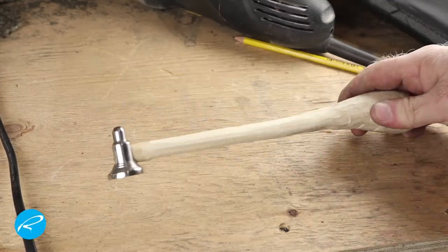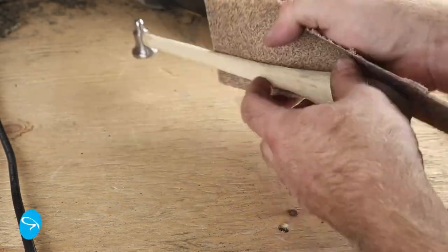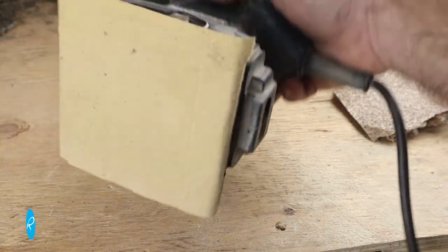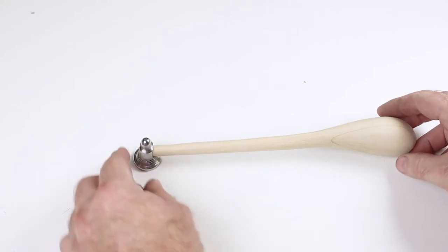It's still pretty thick and chunky, so I'm using 40-grit sandpaper to just tear it down and smooth it out a bit, then I'll move on to 80-grit on a regular sander, and then 200-grit to make it finer still.